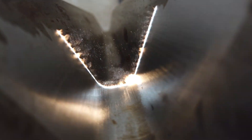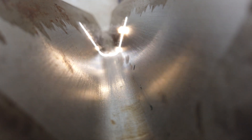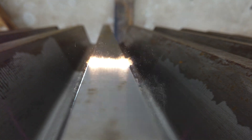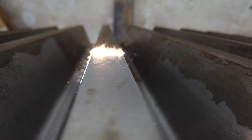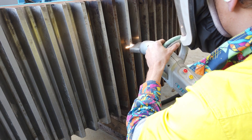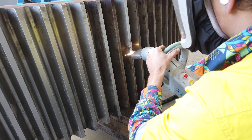Here you can see a nice clean bit of steel. They had previously pressure washed the anti-corrosion coating off the face and we just had to use the laser as a final prep. When we did our demonstration we cleaned a small piece of the girth gear that looked as clean as what you see now. Unfortunately, about 75% of it was in bad condition, so it took a lot longer to clean than we thought and quoted for. At the end of the day the customer was happy. Here you can see me working on a section that was relatively bad — the cleaning speed is quite slow.